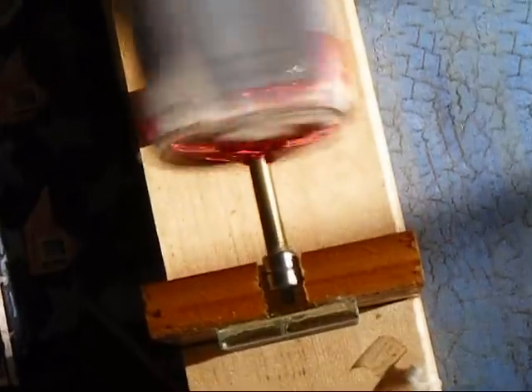I did this by gluing one magnet at an arbitrary fixed position on the armature, and then by trial and error, turning its sister magnet a few degrees at a time until the smallest change in shaft height was observed over one full revolution of the armature. None of the other videos I've seen talk to this point, so whether it's common to all magnets or just the ones I'm using, I can't say. But here it played a definite role in optimizing this unit's performance over its range and speed.